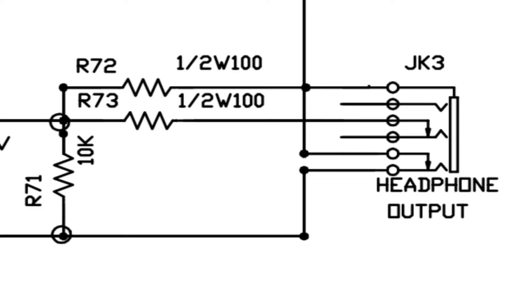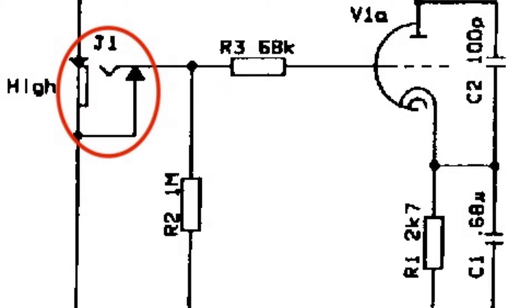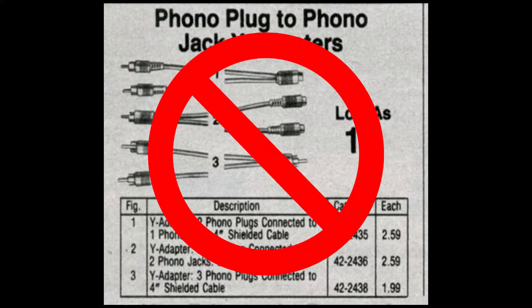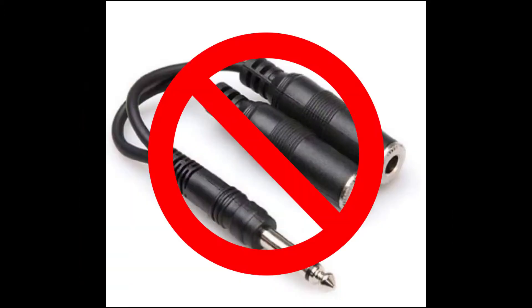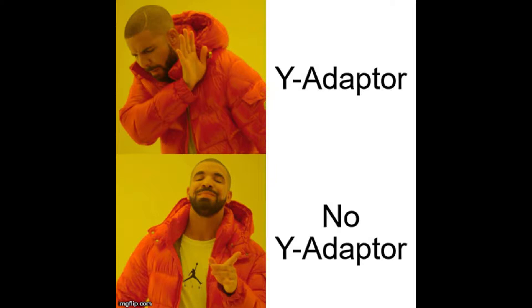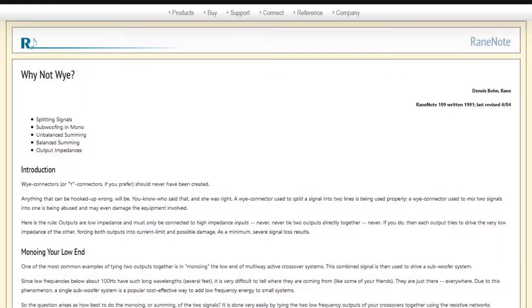The key thing to remember is that the headphone out on your device is stereo. However, most instrument amplifiers are mono. We must not arbitrarily join the left and right sides together — this is called a Y connection and can cause damage to the device. In fact, I've seen iPods actually shut off their output when the left and right sides are connected together without a proper summing circuit, in order to protect themselves. The methods we are looking at here will avoid this issue. I've put a link in the description that explains this in much more detail.